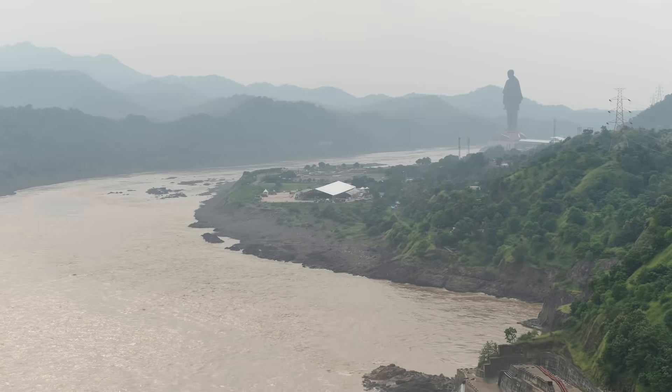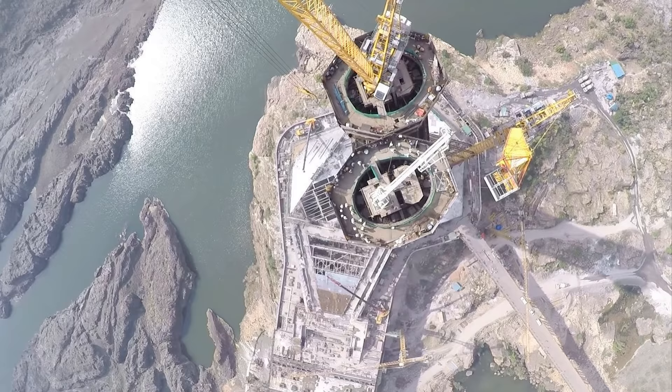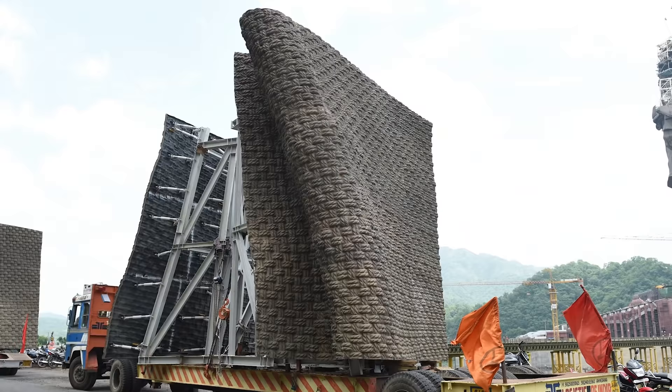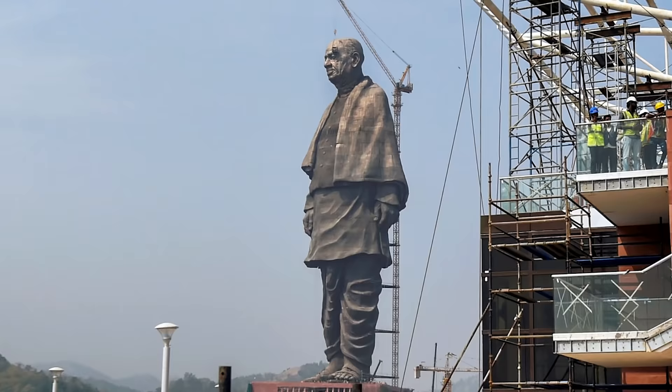Further up, the cores house twin 250-ton tuned mass dampers. The area is occasionally prone to earthquakes, but thanks to those dampers the structure can withstand quakes of up to 6.5 on the Richter scale, to a depth of 10 kilometers and a radius of 12 kilometers. Cantilevered out from the concrete cores is a steel space frame designed on CAD software, onto which the bronze-clad panels transported by sea from China were bolted. The panels are designed to overlap slightly so they can move in high winds up to 180 km/h, preventing stress transmission throughout the structure.